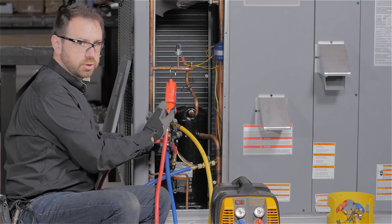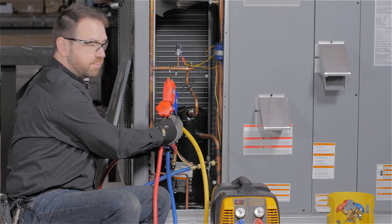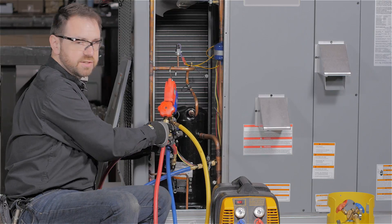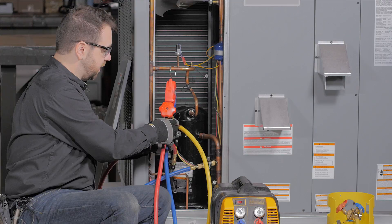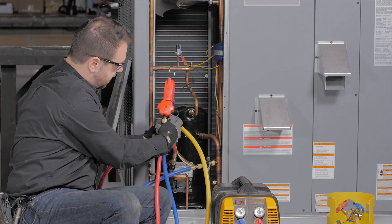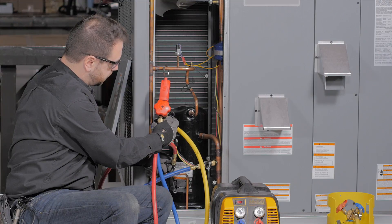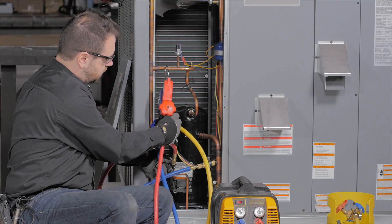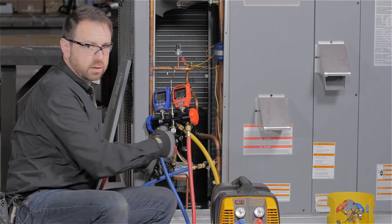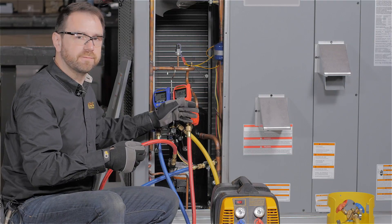In this case, we're going to be purging the high liquid side. I have a port here that I can keep cracked open and I'll be shutting it as soon as I see, smell, or detect any sign of refrigerant reaching this line. Make sure that the valve is fully closed, and now being prepared to fully shut, I will crack the valve there, closing at the moment that I have any belief that refrigerant has fully reached that point.